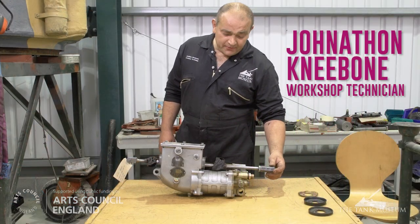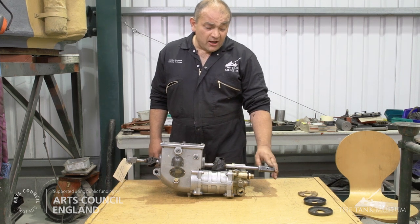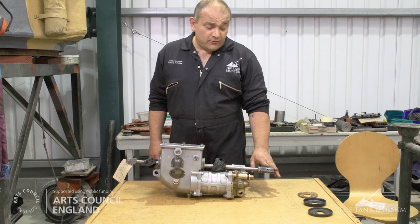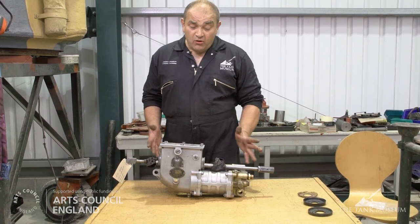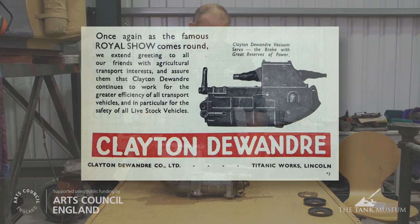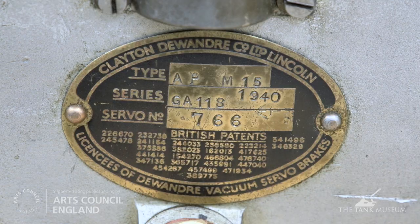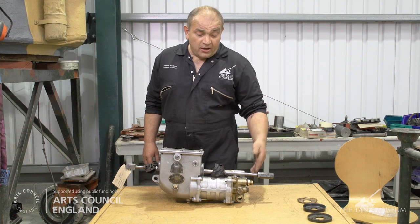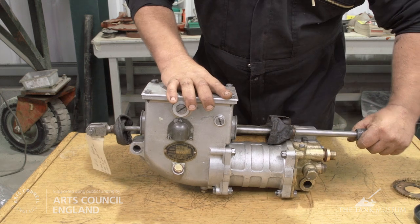This is the air servo that helps change the gear, or helps the driver change the gears, by giving him basically a leg up, because if he had to do it on his own, it would be too hard to operate. You can see it now in its restored form, with a couple of exceptions, which we'll go on to later. But essentially it consists of a really big piston on the bottom, which is injected with air. When the driver operates the gear change pedal, this system activates, and through a series of linkages, changes the gear